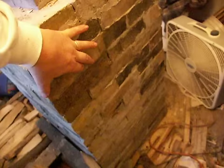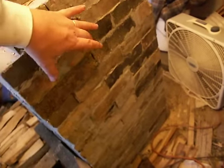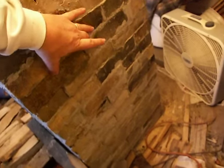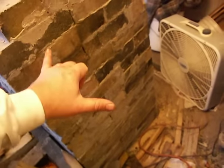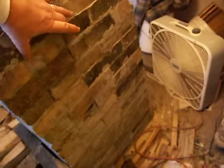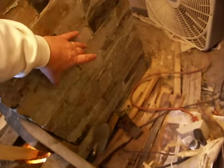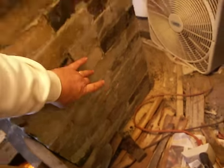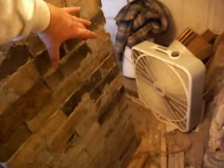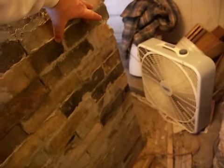The heat riser inside here is four and a half inches open by nine and a half inches from left to right. The heat riser rises right up through here from the bottom of the burn tube, up through here. Heat crosses over across the top here, and then my first downdraft is right over here.